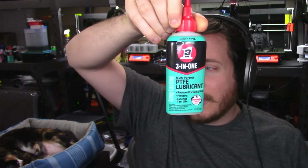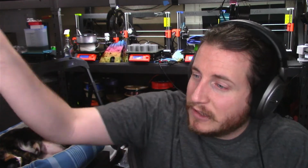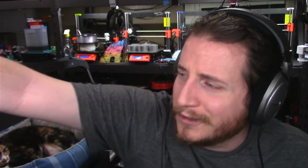Now, this has never been fully confirmed or debunked, but we do this, and we've done it ever since, I think it was Uncle Jessy first published the video. We put some 3-in-1 PTFE lubricant on all of our vats. A lot of people say it doesn't do anything. Well, I think it works, and if it doesn't do anything, it's probably not going to hurt either. We believe that this helps that peel force come off quite a bit easier, but that's just my opinion. And for $4 for a bottle, it was cheap enough to try. I've never had any detrimental side effects that I can tell, so I've never bothered to change the method. It seems to work well for us.